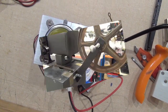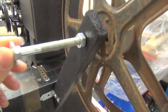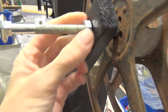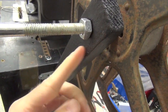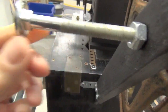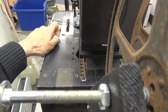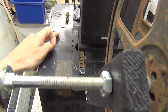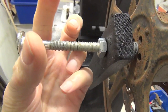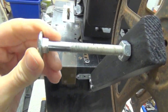I've made a wooden take-up arm, now painted black, attached with brackets. The spindle at the moment is fixed but it needs to turn, so I'm planning to have a metal plate either side of this arm with a hole so the spindle can turn within that, with a pulley probably driven from one of the smaller motor pulleys. I have no idea what size this pulley needs to be, so I'm going to make a big one from wood, see how that goes, and then work out if it needs to be smaller before buying a metal one in the right size.